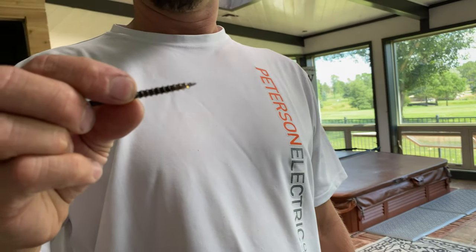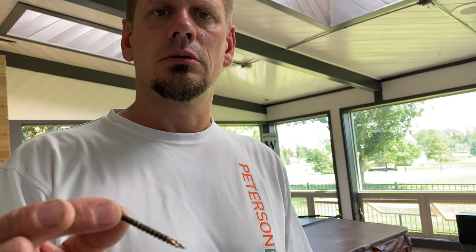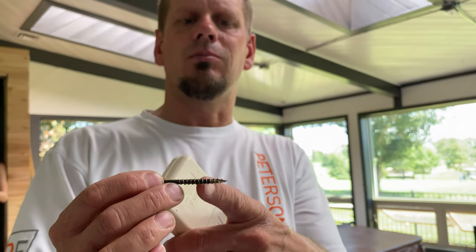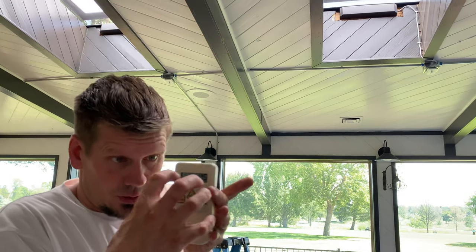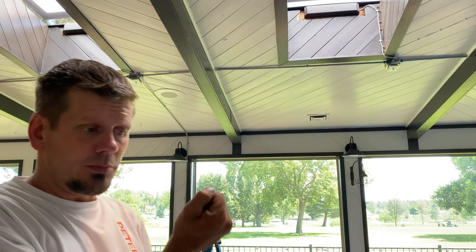Kind of like I've seen with screws hitting wires inside cabinets — guys put long screws to hold up a cabinet and end up hitting a wire. The bottom line is right here: you can see that tip — he definitely hit the chain, and it was binding and grinding. So I took it out, and it started to finally free up with my channel locks. I don't normally like taking apart motors, but I took the motor apart, removed about seven of these little gears, took a picture to remember how to put them back in, and was able to free up a little shaft with the channel lock. There's a C-clip there.